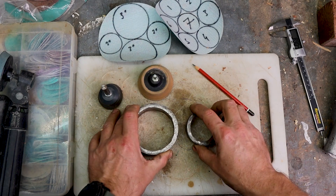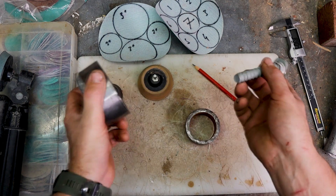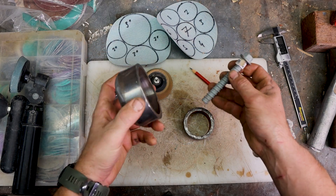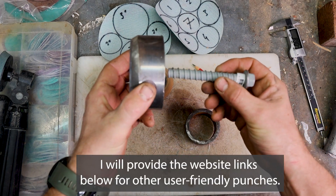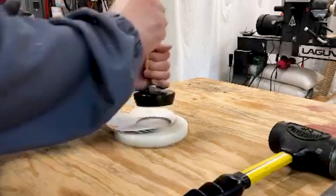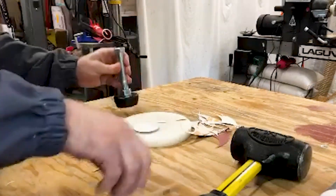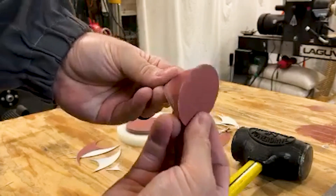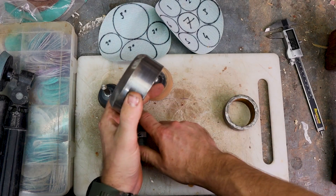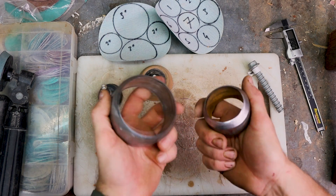If you're looking to invest in getting your own wad punches, the ones I would highly recommend — and I'm not sponsored or backed by anyone, this is purely to help you — are made by Glenn Lucas. The beauty of his design is they've got a bolt on the back. That bolt is great because when you're trying to hammer these by hand, you end up nicking your fingers. With the Glenn Lucas version you just hold the bolt, punch cleanly, and it spreads and distributes the force evenly. When sharpening, that bolt also lets you hold it steady and turn the head as you sharpen.